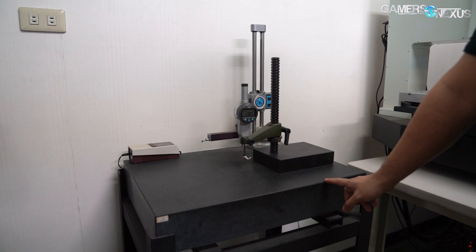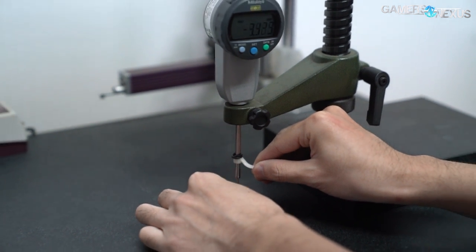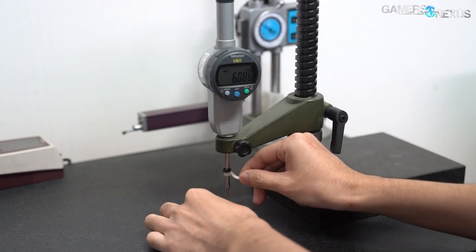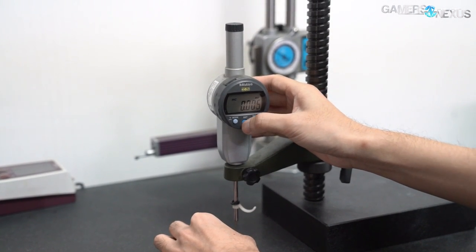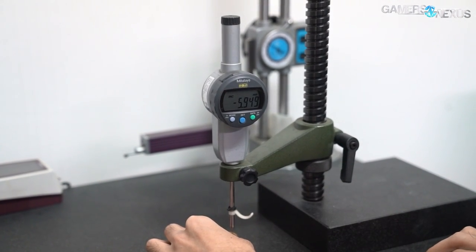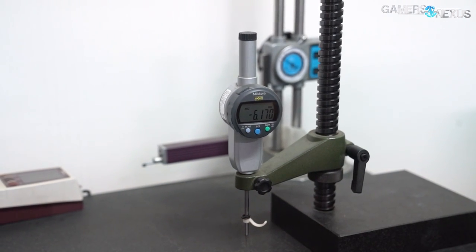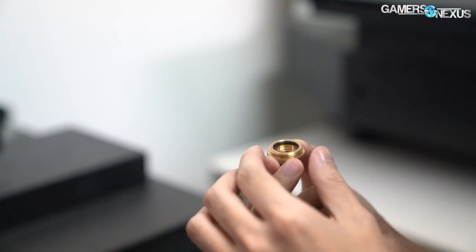The slab is accompanied by a depth gauge similar to our own, although much more expensive at $2,000 just for the data logger — the Mitutoyo SurfTest SJ210. The gauge itself uses a probe and tests the depth versus a known zero point to check the levelness of a surface. This equipment is all expensive to buy, but it's also expensive to set up and train for. It needs to be checked routinely for accuracy and recalibrated, or at least recertified regularly, like most precision instruments. BitsPower uses this to check for levelness of new product surfaces, engineering accuracy, and also for production units.